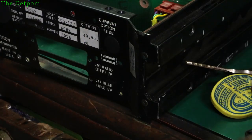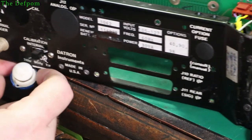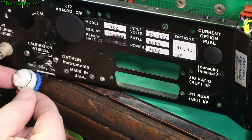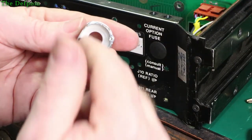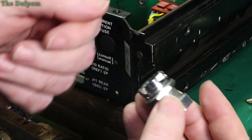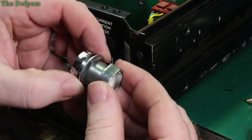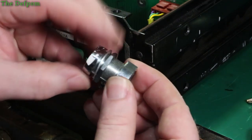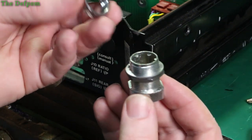This is what's on the back of that switch piece. There are holes on the sides - one each side - and that goes into the back of this assembly, which is the switching mechanism. The bit pops into place via the detents. When you get this switch out it's actually fairly easy. There's a locking nut on the back - you just loosen it off and that takes the tension off, then you can unscrew the front bezel without having to dig into it at all.